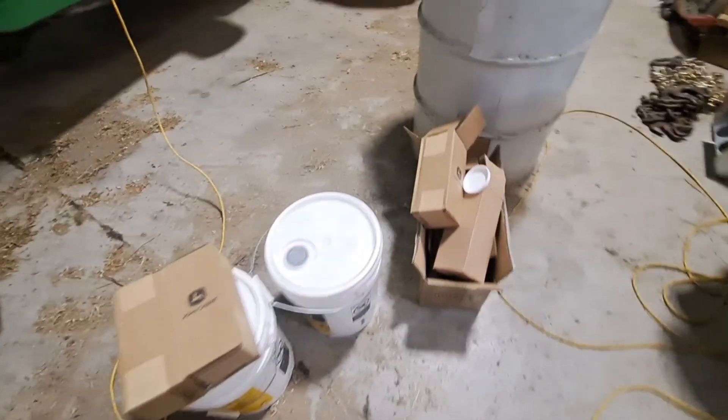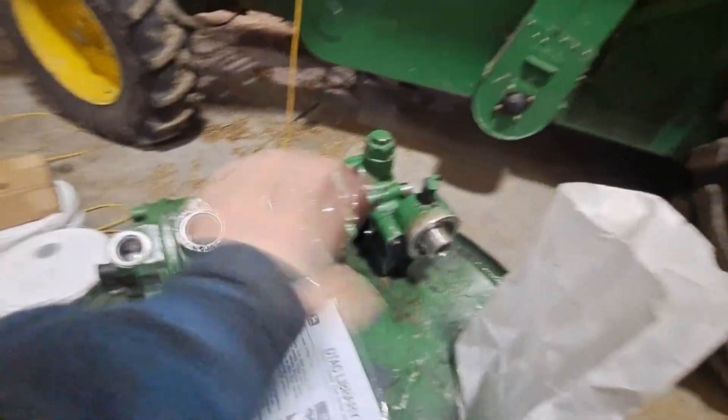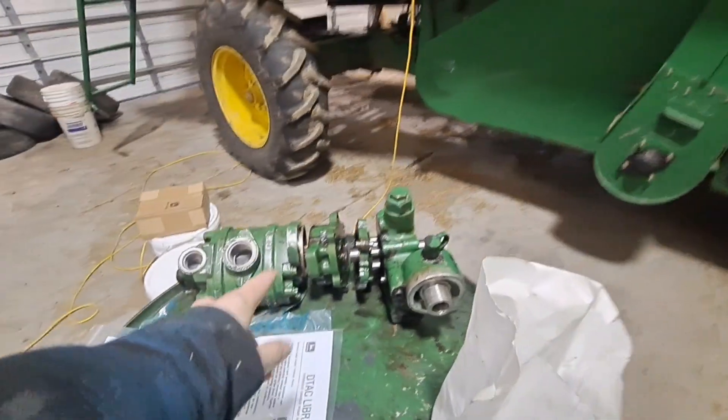That charge pump is very fatal for this combine when it breaks. This was about a six-week wait for the new one — it looks different but goes back in the same way. We cut open all the filters and changed them to see if there were any filings from when the pump broke. There were none, so we did not have to do a flush through all the lines. Filings would tear up all the seals and you'd pretty well need a new machine — you can't get every single one out.